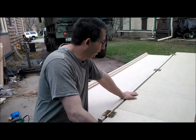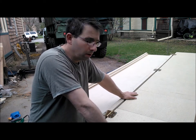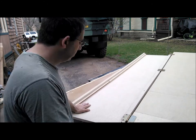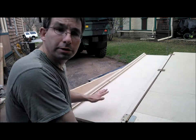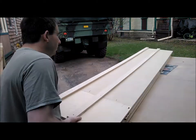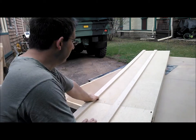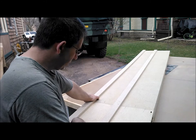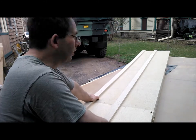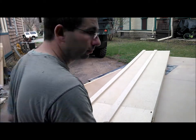You should be able to even use this if you have a long piece of dimensional lumber — just throw that in there to make sure you've got one edge that's perfectly straight. It's pretty simple and easy to make. We're going to need a couple of hinges and most of that sheet of particle board, and we'll be good. And this is what I came up with — a little bit more than a sheet of particle board, I used some scraps I had laying around. We've got a nice tray here in which we put our material to be trimmed down, and a lid with a track for the circular saw to ride down. All I've got to do now is cut a hole in here for the circular saw, then give it a test.